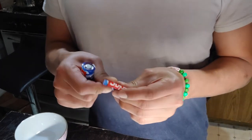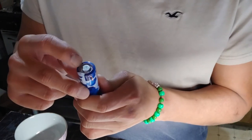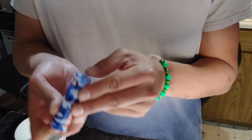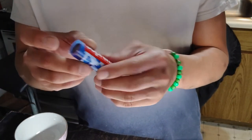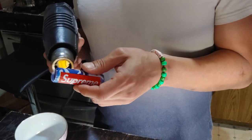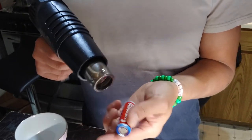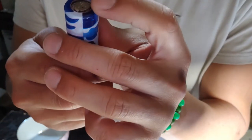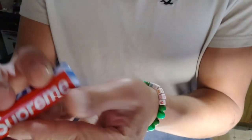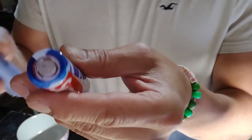You can make it double if you want — let's make a double insulation of the Supreme on top of the Supreme to make it even more insulated. Let's say you missed a spot. I feel like the metal spots are still showing so I'm going to make sure. The bottom doesn't matter — it can be shorted. For the top you want it a little bit higher, so this time I'm going to wrap it a second layer and really get those negative ends. Boom — that looks even better. I gave it a little bit more space, shrink wrapped it. I've got the Supreme Samsung 40T Tesla battery, perfectly insulated. In fact this is double insulated versus a stock Samsung 40T.